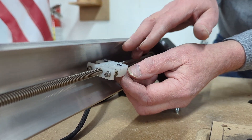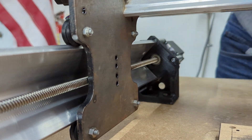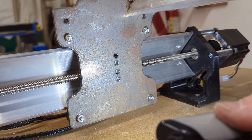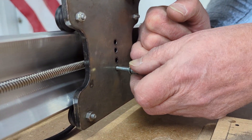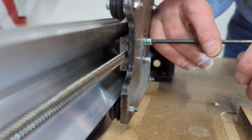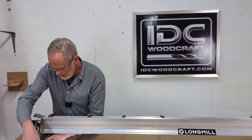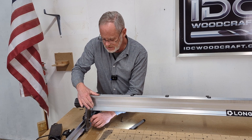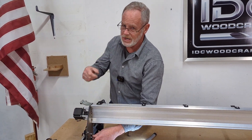When you put the nuts into the hex holes, make sure the nylon is facing this way — look for the little red ring on your LongMill nuts. I'm slowly bringing the gantry back until I can see the nut, then I'll put my finger in there to hold the bottom nut and start the screw. When tightening these anti-backlash nuts, they are nylon so you don't want to over-tighten, but you do want them tight — I'm pressing pretty hard against the hex wrench and I'm very comfortable with that.